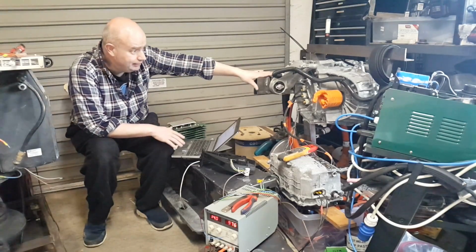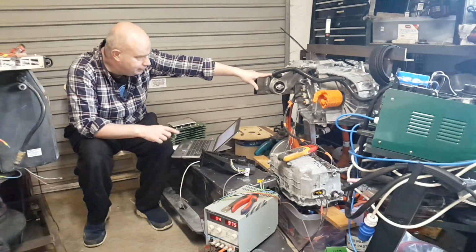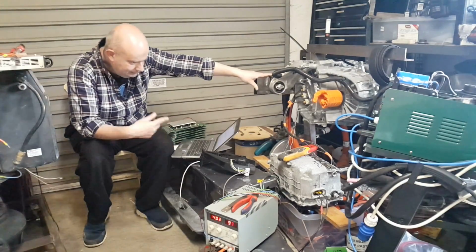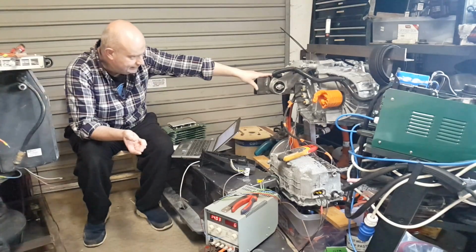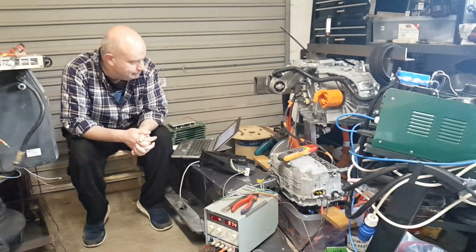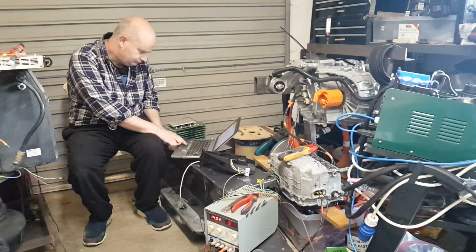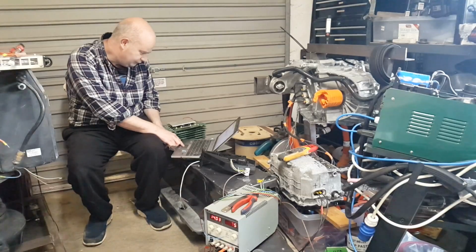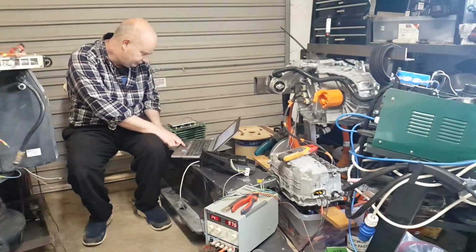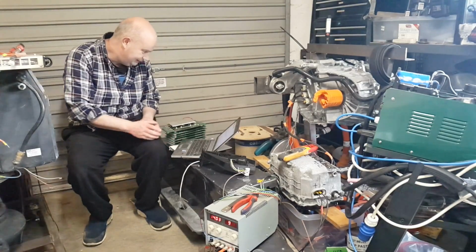During that, if we plot the angular position of the rotor as it's being received from the resolver, we do see rotation. The stationary jitter is about 1 or 2 degrees. Actually, let's have another look at that while we're here. I think my next move is going to be to try a different motor, at least one that I know how to spin. I did have to come into this with the one motor that I had no idea about.